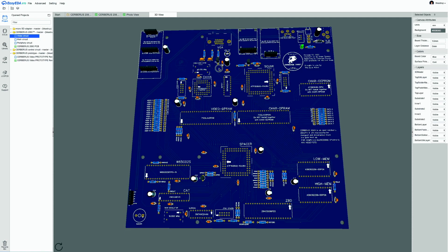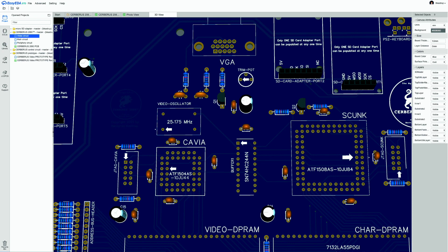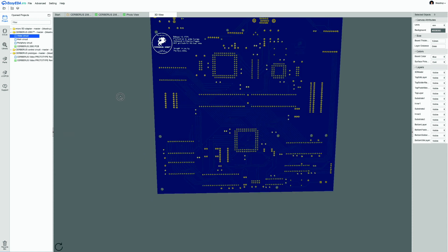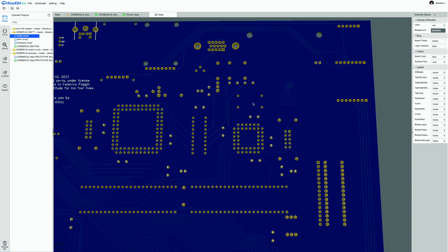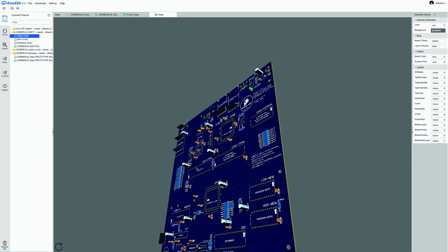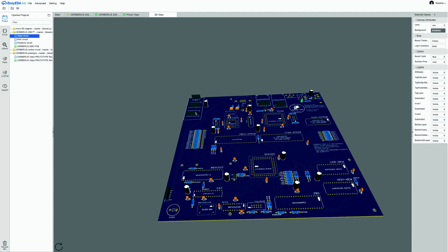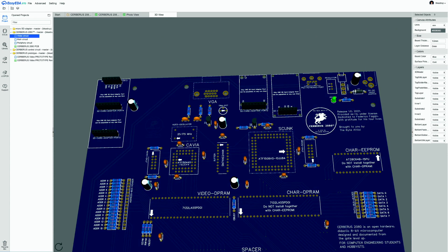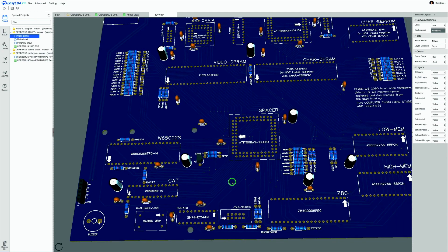That's how the board looks in 3D. The back side also has silkscreen markings and copper-etched identifications. The SD card ports are standard pin header slots — two accept horizontal flush adapters, three accept vertically inserted adapters perpendicular to the board, as does the FTDI adapter.